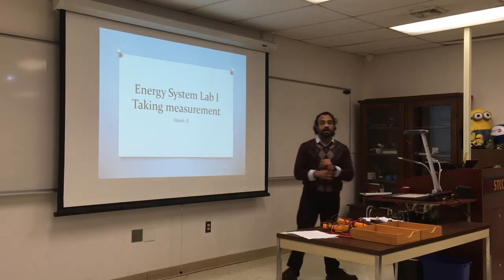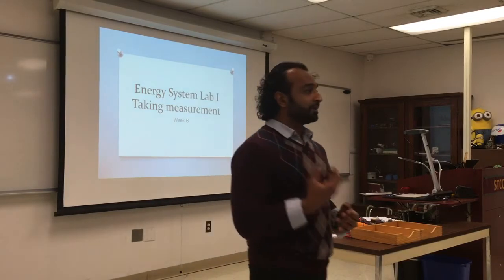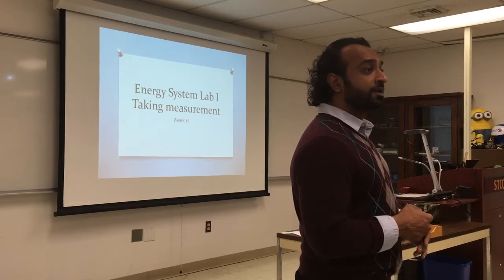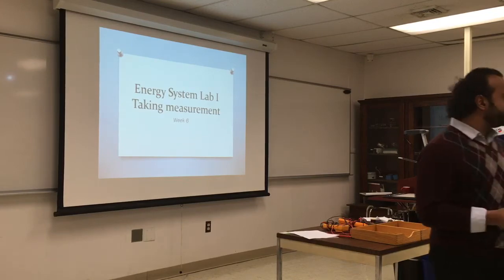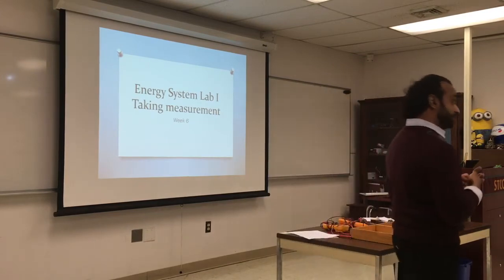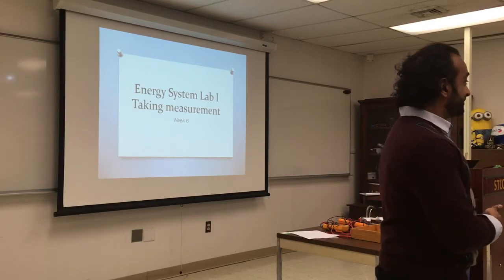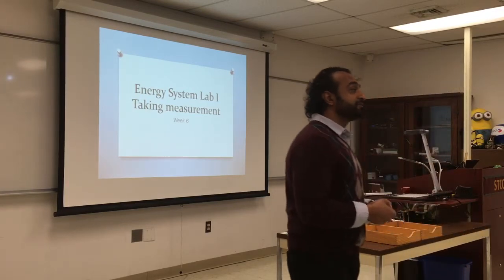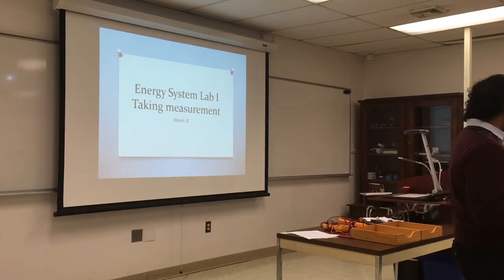And again, as I said before, 80% of troubleshooting for all HVAC equipment is what? Electrical. So if you know how to test electrical equipment properly, you have saved yourself a lot of money and time. If you know the problem is the motor, and you change the motor, and it turns out to be the motor, you're a hero. If it's just a fuse and you change the motor, you waste somebody's time and money. So knowing what is the faulty part is very, very important. That's why you get paid a lot of money doing that. And it becomes easier and easier as you have more practice.